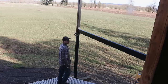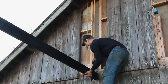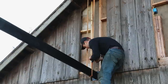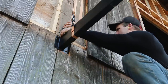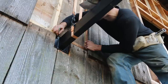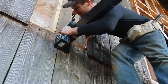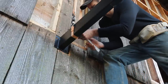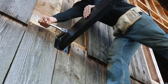Sorry, there'll be a little beeping in this video — I had some adrenaline going. I used the strap to raise up the end on the barn to my mark. It took some work to figure out what height the deck needed to be. I wanted the top of the deck to be level with the floor inside of the barn so there's no step up when you step onto the deck. I marked the center of a couple of the holes and then drilled them out for the three-quarter inch lag screws I was going to use. I got the top two in about halfway — not tightened all the way just yet so I could still move the other end a little bit and make sure it was positioned where I needed it.